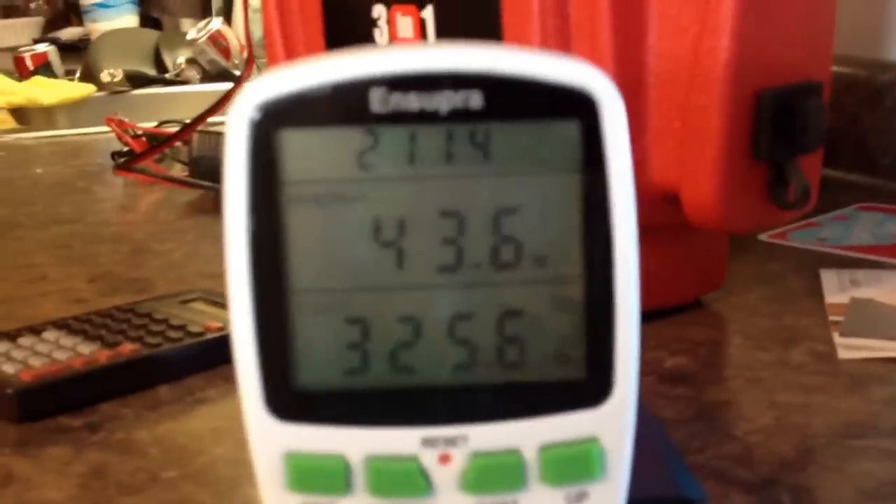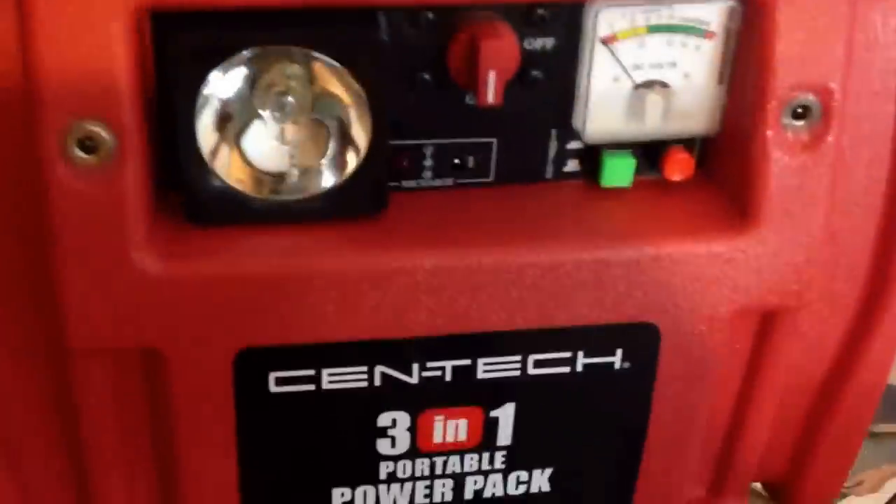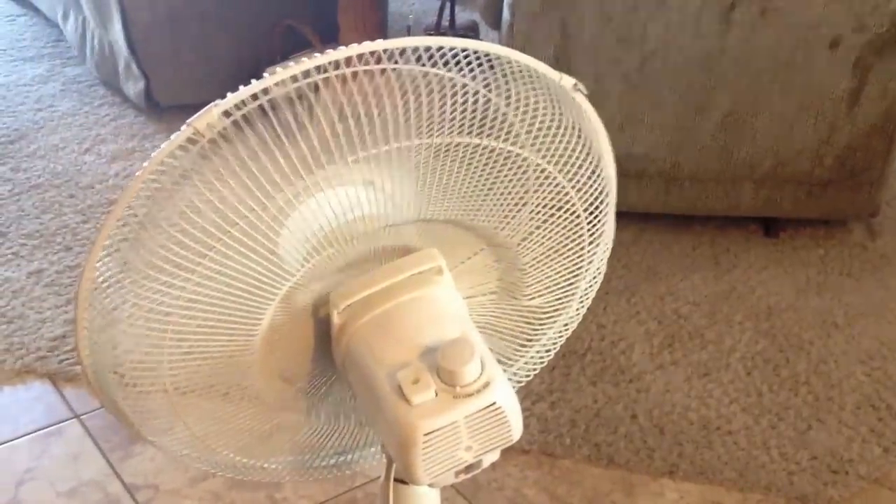This is more like your household electricity that the electric company supplies. These Pure Sine inverters are also more efficient — they run more efficiently and don't use up as much electricity. Right now this fan is running at 43.4 watts. So you divide that: about 45 watts divided by 12 equals 3.7 amps of DC being drawn out of the battery. This is a 17 amp-hour battery, so you could run this at about 3.75 to 4 amps per hour — meaning you could run this for about 4 hours before you drain your battery, then you'd have to charge it up again.